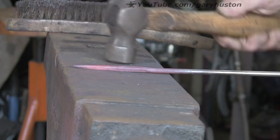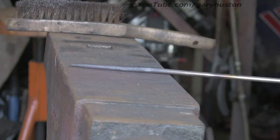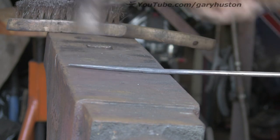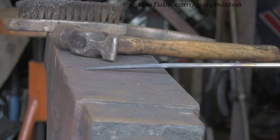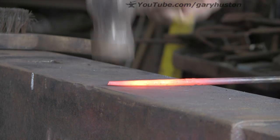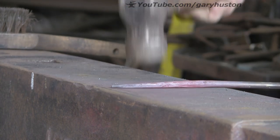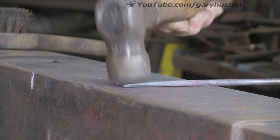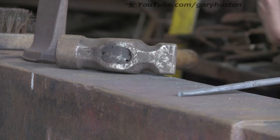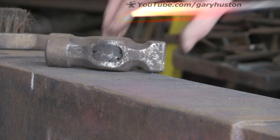Weird stuff to use, this stainless — just unlike mild steel for some reason. It works quite nicely with this dark or black heat. I'm just going to try and get it down a little bit more. I've got a split at the end — that's really come apart, so that's no good. I'm just going to whip that end off and then draw that out again. I think I've been working it too cold for too long, and that's really messed it up.